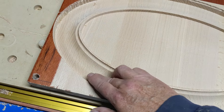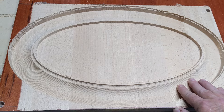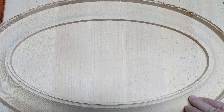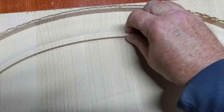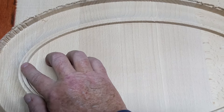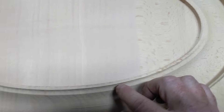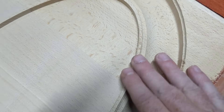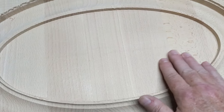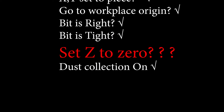That's the backside done - really happy with the way it came out. It's always hard to tell on the Vectric Aspire program exactly what you're going to get, and remember you always have two options: you can go for speed or you can go for really fine, so it becomes a question of how much sanding you want to do. The ridge plate on the back looked really centered in the layout, but you can see here it's a little thin in spots - it'll be fine though.